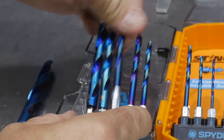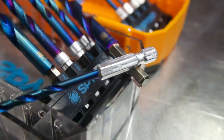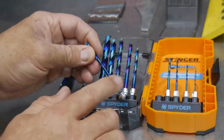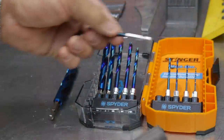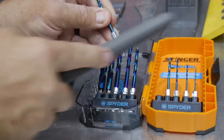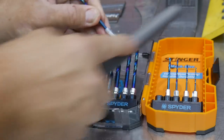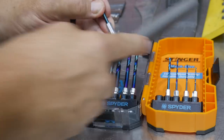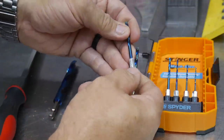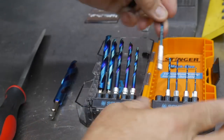Another thing I noticed in the cast aluminum — you can see a little tag left on that casting piece — it left a little bit of residual ridge. There are two ridges, one on each side, 180 degrees apart. I would definitely recommend taking a quick file or some sandpaper and knocking off that ridge, because that could potentially cause an issue in your impact wrench when you slide the bit in and out. It shouldn't cause an issue in your drill, but just dress that quickly with a file or sandpaper to get that cast aluminum back nice and rounded.